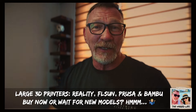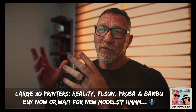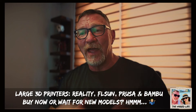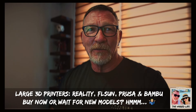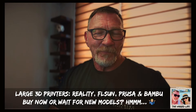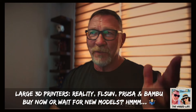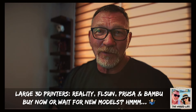The larger the nozzle size, generally the more you can print and the faster — but for more detail you need a smaller nozzle. Most printers ship with a 0.4mm nozzle as the standard, though some people look at getting smaller or larger nozzles for different purposes.